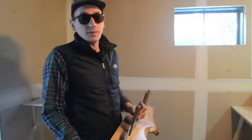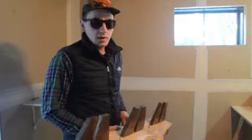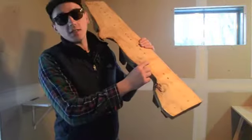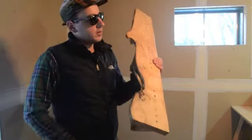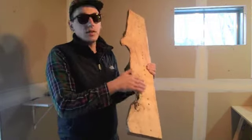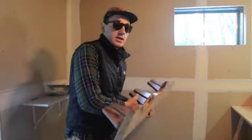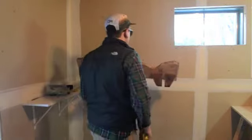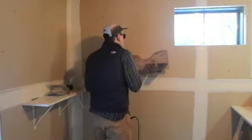Once you've started 2 of the screws into the pilot holes, you want to drive them in with the drill and make sure that they poke out just slightly from the back. You barely want any of it visible, just enough that you can feel it. This allows us to line it up with the anchors that we installed earlier. You then take the rack